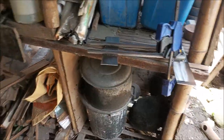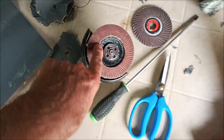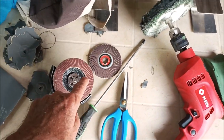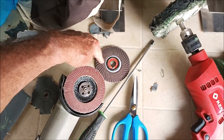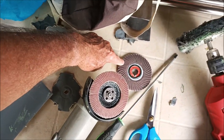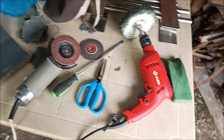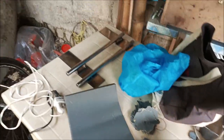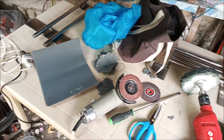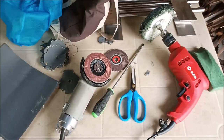So after the 320, I put the 400 on and remove those deeper scratches. Then the 1000 removes the shallower 400 scratches, and then I buff it out with buffing compound and it comes out to a nice mirror-like shine. As you can see, that matches the tarpaulin cover brackets because they're polished mirror-like 304 stainless steel.